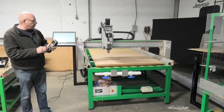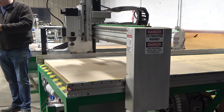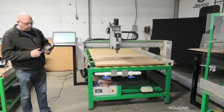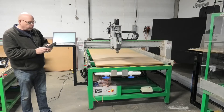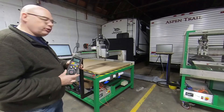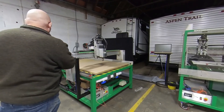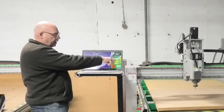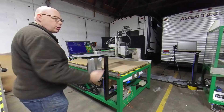This one also has the optional jog pendant. So with this MPG jog pendant, I can turn the knob and the machine moves, and I can select which axis — X, Y, or Z — and get it right where I want to be. I can also start the machine just by hitting the start button and do all my controls right from here, as well as stop it. Alternatively, we can use the jog features that are just on the screen, with all the same features for moving X, Y, and Z — click here to do it, start my program, and so forth.